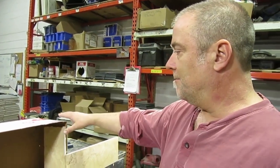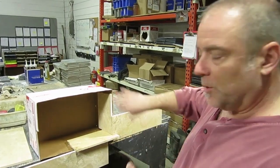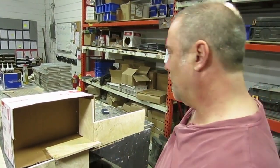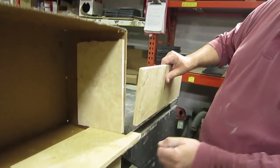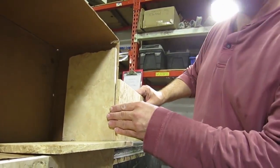This is an example of how we're going to put together the niches. This will also be how you'll handle the cutout area above the fireplace. Here's the piece I just made with the polished edge. This piece is going to be installed afterwards — we might be notching it out depending on how we decide to install. That's going to be the finished edge.